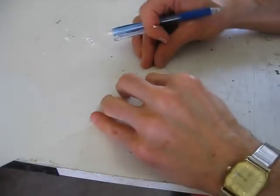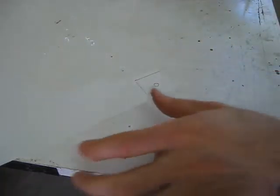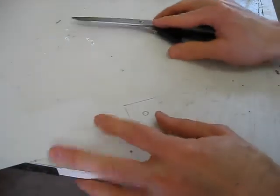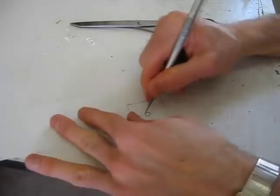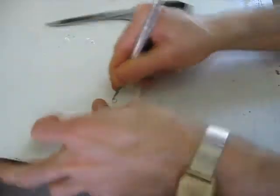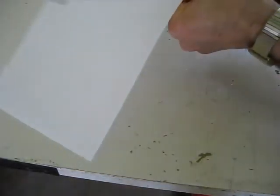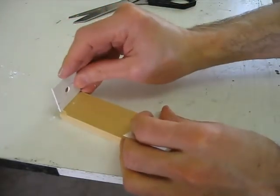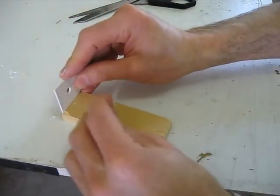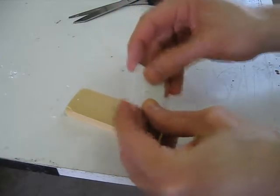Next I'll take my thin plastic and trace that out. I'll make the hole first — if I cut the piece out first, I'll have trouble holding onto it while I make the hole. Now I have a problem: the thin plastic is fairly flimsy. So I'm going to make another piece like this and glue it on as a frame for the outline — that'll give it some stiffness.